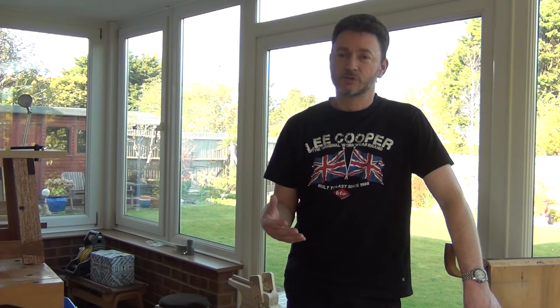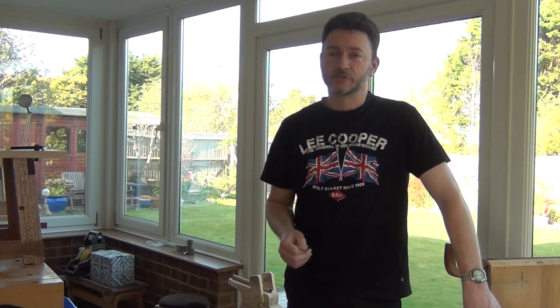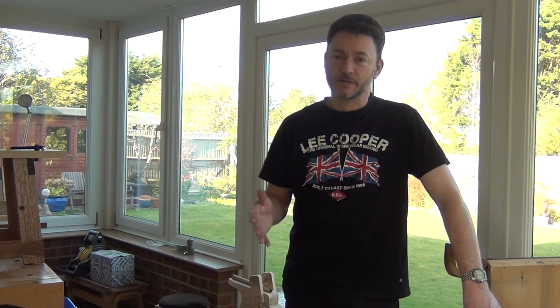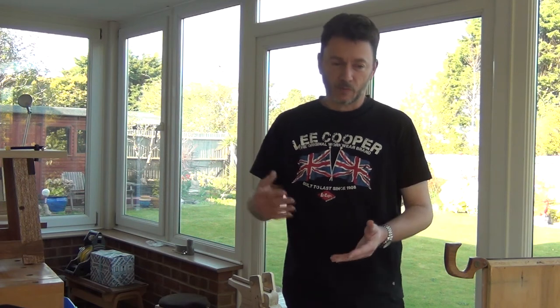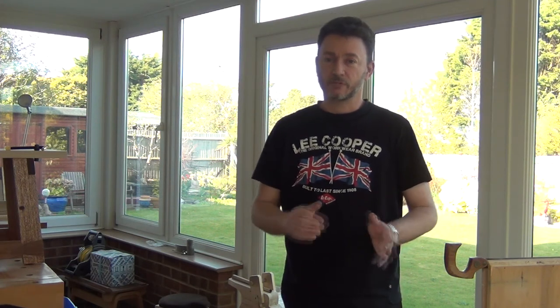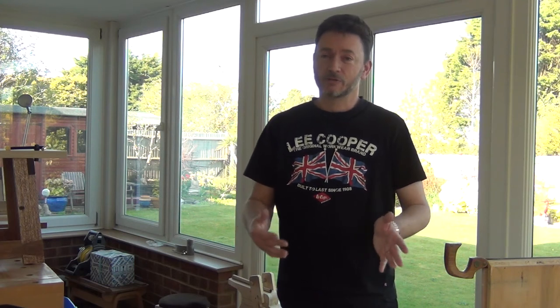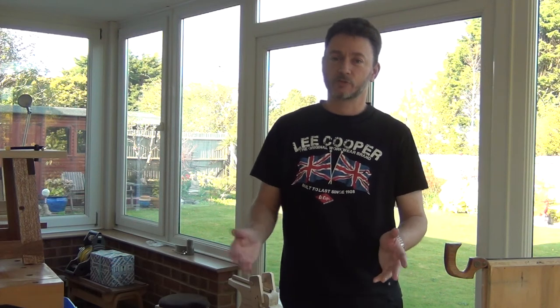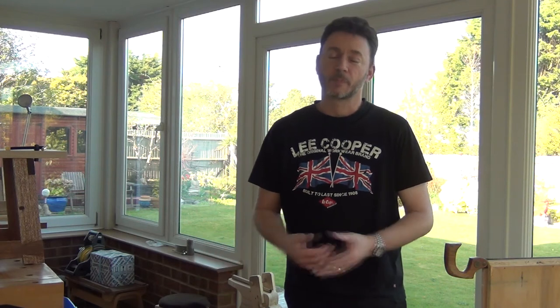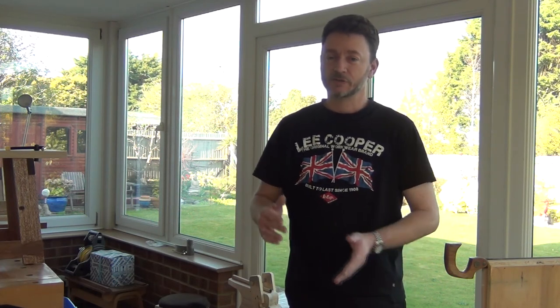I want to say a little bit about sharpening saws. First of all, a warning: if you haven't sharpened saws before and you don't know what you're doing, don't just watch a video and grab yourself some files and start going at your saw. Because the chances are you'll actually make it worse than it is already. Even if you think you understand everything, pretty much assure that the first few times you do it, you're not going to get the results you're expecting. So grab yourself a couple of really cheap Western saws at a flea market — one cross cut, one rip cut — and practice, and practice, and practice again. Don't touch even a moderately priced saw until you know exactly what you're doing.